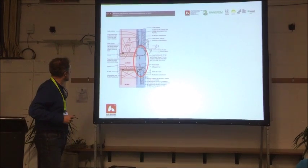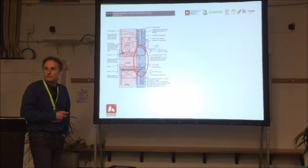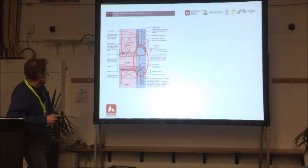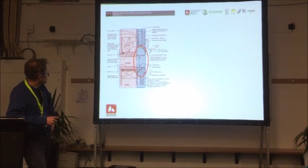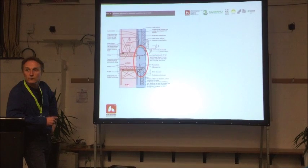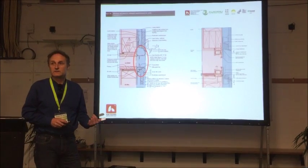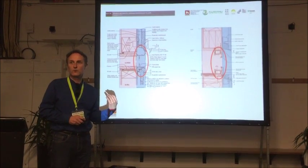The problem with that is the weatherboard, the drip board, the drainage and ventilation cavity — that's where our window is sitting. That cavity has cold air in it all day, every day, and it can have moisture in it. The pink is the warm part of the wall where our insulation is. We didn't do that. It's standard practice in European countries to recess the windows, so we recessed the window into the warm part of the wall.